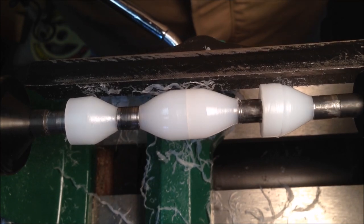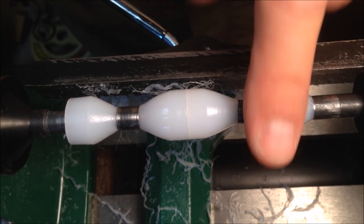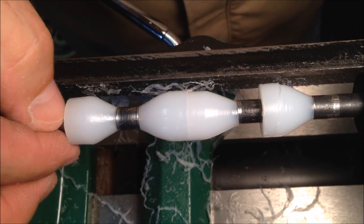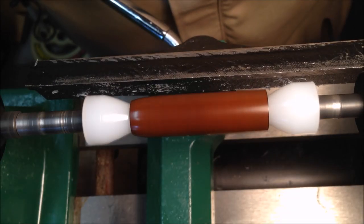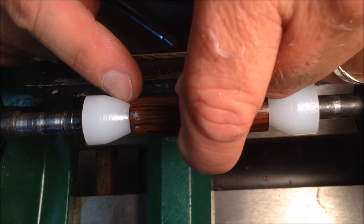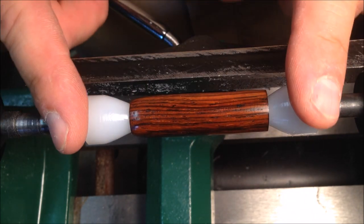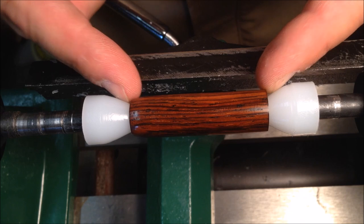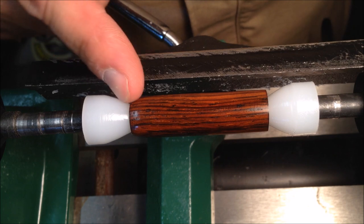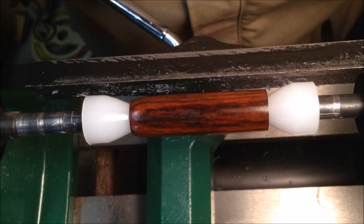They may not be beautiful, but I guarantee you they are highly functional. I'm going to clean this one up a little bit where I got a couple of gouges, just true it up, and then toss a pen blank on here and see how well they do centering it up. With these being conical shaped, they self-center on the blank, and you can wipe your CA glue finish right on. If you get any on these, it doesn't stick. As they get gummed up or chewed up, I can take my skew and freshen up the edges — these are going to last a really long time. They're not pretty, but they are highly functional.